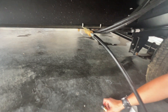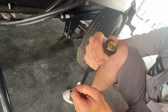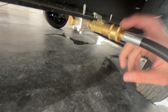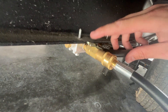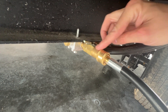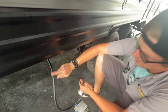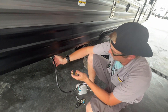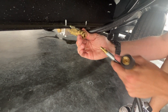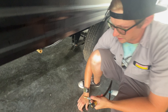That is also the same on this end — you can draw back on that, expose your ball bearings, let go, and that's going to lock it into place. When you want to draw gas from your unit into the LP quick connect hose, you're going to take this out, open it up, and run it parallel with the pipe — that's going to allow propane to flow from your tank and lines down through the hose into whatever you decide to hook up. To detach it, you draw back on that same copper ring, expose the bearings, pull it out, and this locks back into place.